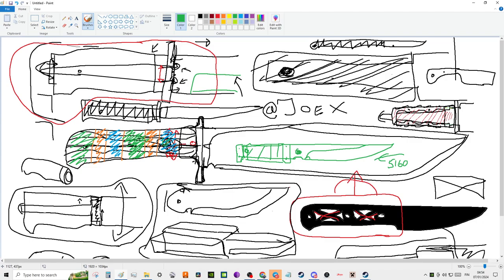the rivet lock system itself, I find just so nice and useful and comfortable to have on a blade, because it just makes the entire profile streamlined. So, that's what I mean about earlier. Sometimes if you want to add some functionality, or you want to add some aesthetics or something like that, you're gonna have to drill a hole somewhere, and you just have to be careful. And you have to think about it. You've got to chamfer those holes.